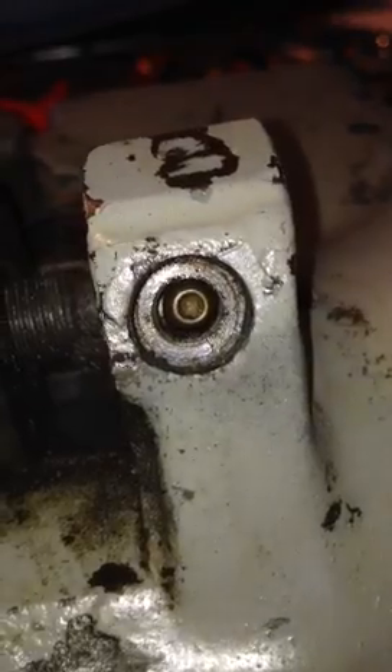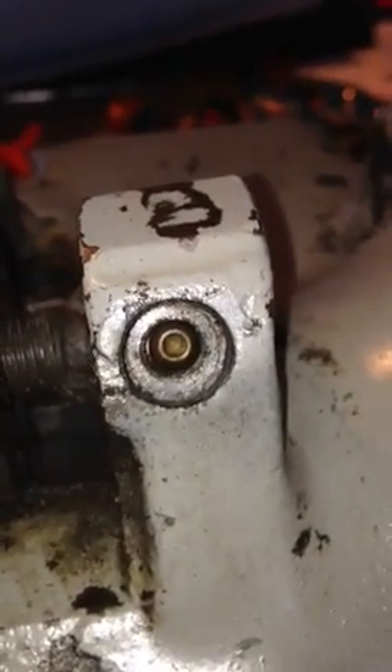So that's out. What I'm going to need to do here is screw in — this feed trip ball lever is down in here and there's a female thread that I can screw a number 4-40 machine thread into, and I should be able to yank it out.